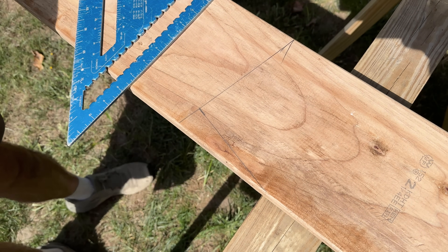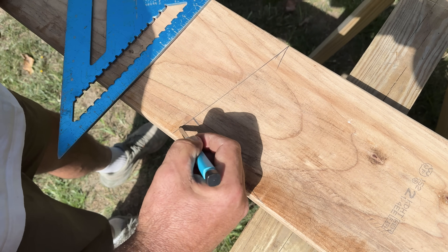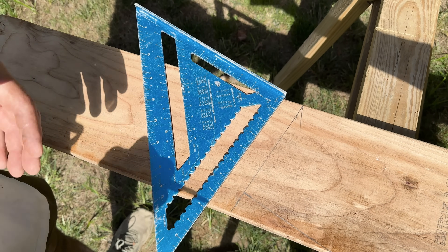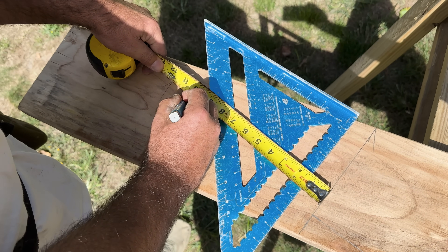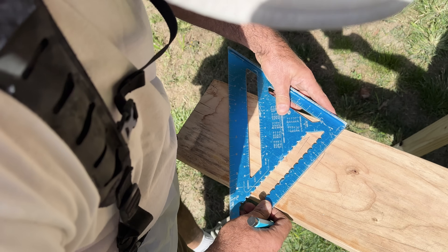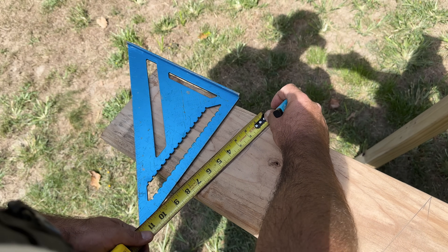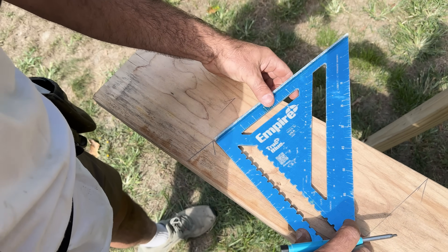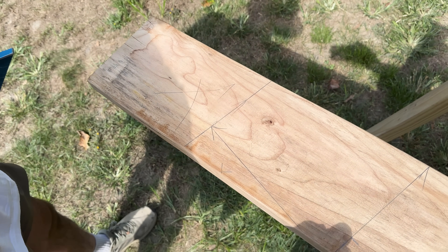Square that across. This is what's going to sit on top of our 5.5-inch beam, and this marks the outside of the wall. Now we have to make our soffit — we're going with a 12-inch overhang. All you have to do is measure over 12 inches, then subtract an inch and a half because you're going to be putting a sub-fascia on. Set your speed square to 3, hit your mark. We're using a 2x6 fascia, so measure down 5.5 inches — come up maybe 5 and a quarter so it doesn't come into play. All that gets cut out.